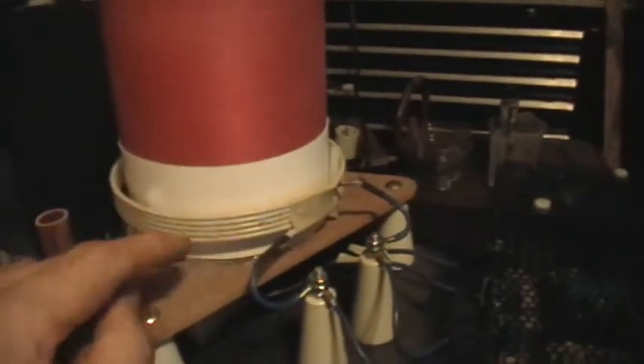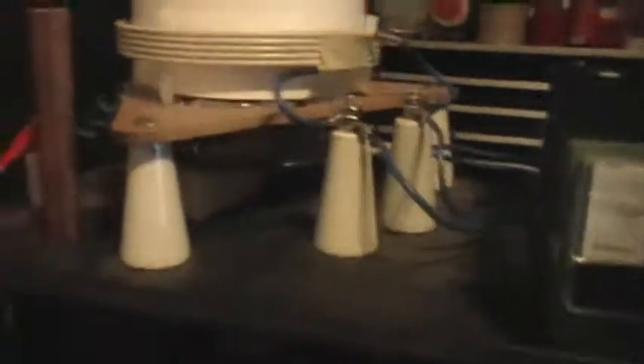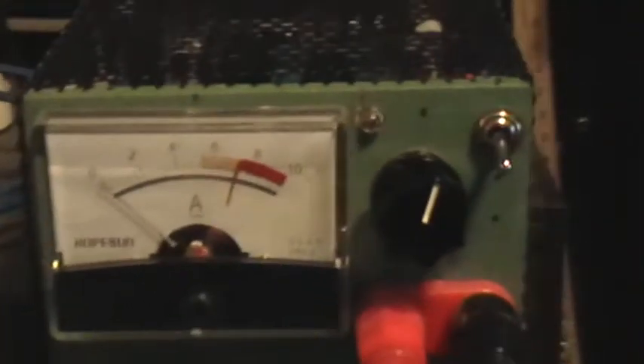The height, I found out, is pretty critical. Underneath there you can just barely see the single-turn feedback coil which triggers the system and makes it oscillate. That green wire there is the bottom end of the winding on the secondary. It's connected only to this pole, which then goes to my outside earth ground — which is also necessary for this system to operate. The primary and the sense coil both go into the driver board.